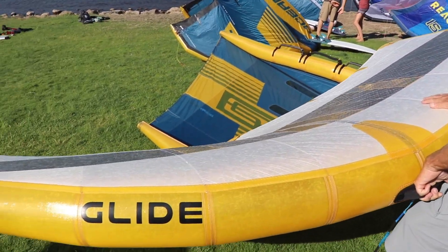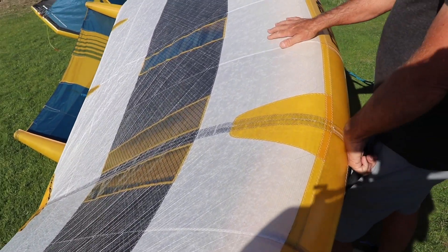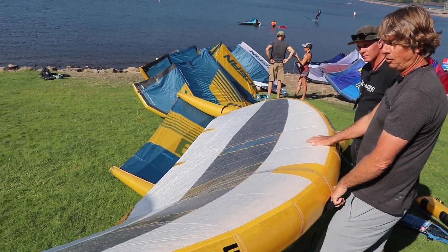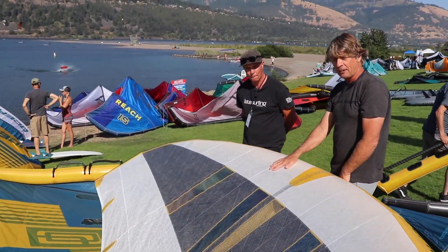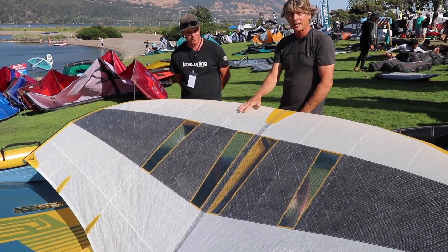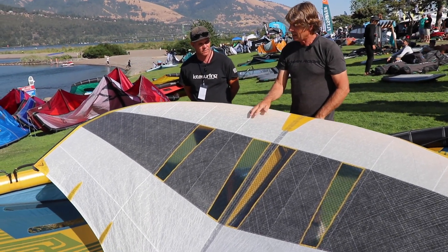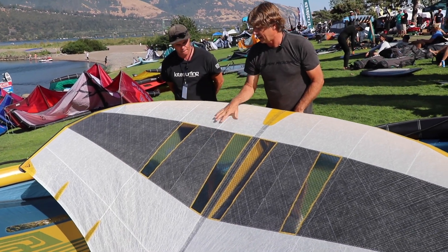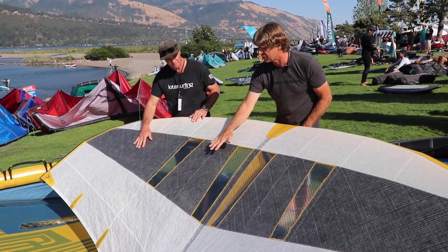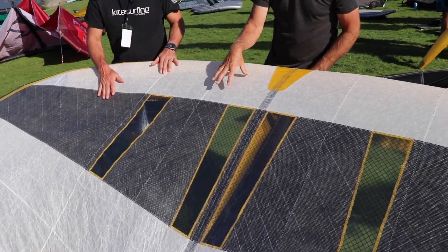It's one of our new series of fully recyclable composites at Alula. We're striving for everything to go recyclable. At the end of life or even in the factory, the scraps can be chopped up and turned into a fiber plastic material that has other uses. The different colors also have different UV treatments — the dark color uses graphite in the polymer, and the white uses a UV inhibitor. It's the same material, just different UV treatment.